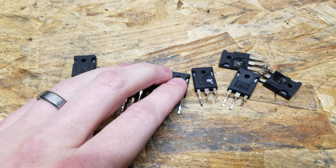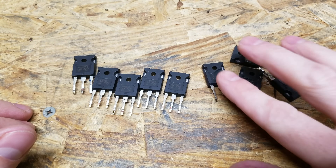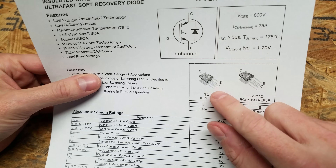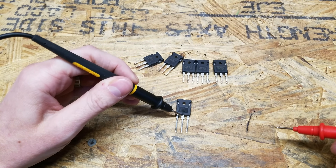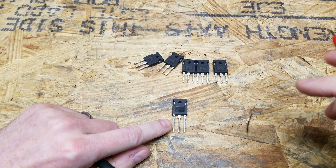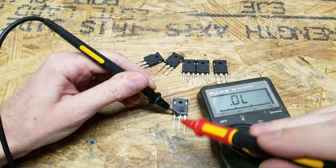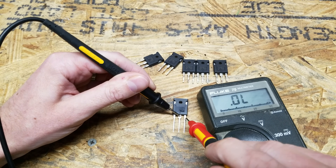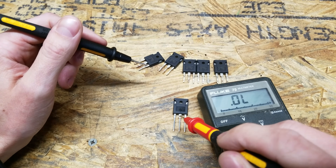Here are the nine transistors removed from the circuit board. These four are bad, so there's obviously no point in testing them — even though this one appears visually good, this leg had actually melted during the fault. So we'll throw out these four. Going to use our multimeter on the diode setting. I went online and picked up the datasheet for this particular transistor, which identifies the gate, collector, and emitter pins. So with a known-good new transistor, putting the negative lead on the collector and the positive lead on the emitter — you can see there is no short, so we know this transistor is good. I should also be able to test that the gate pin will turn on the connection between the other two, but for some reason my multimeter is not doing that, even though I've watched other people do this numerous times. If you have any idea, please let me know.